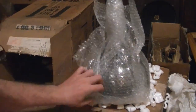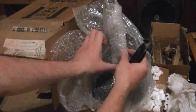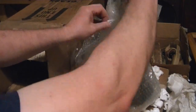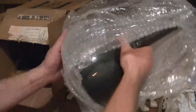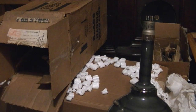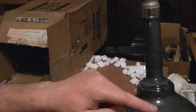I was just saying, I don't have use for this. It won't fit into anything I have. Magnetic deflection and similar voltage to a TV, but the base is different. So I couldn't just plop it into one of my black and white TVs. I'll make an adapter. Also, the deflection angle is a bit different. As you can see, it's quite short compared to the 10-inch CRTs. But it's kind of why I wanted it. It's a rather unusual shape. That kind of bump in the neck there, and high voltage connector sticks out.